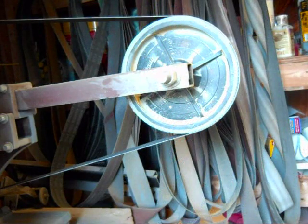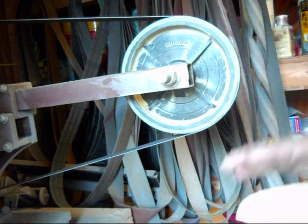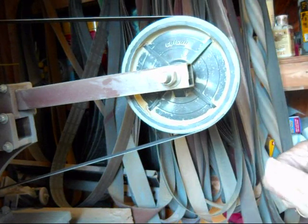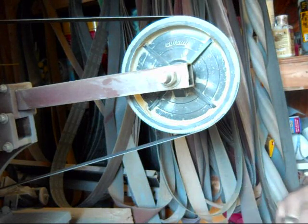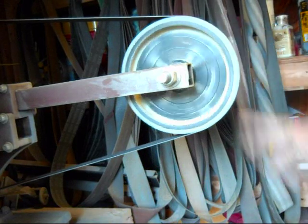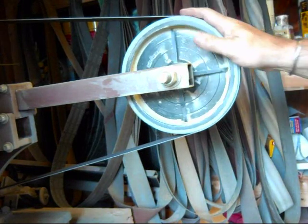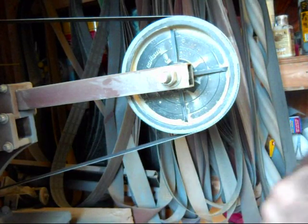All right, the next step I use, and if you don't have a belt sander or a grinder, you can use other tools to do it. You can hand sand it to even things up, or they have burnishing tools to smooth that leather out. But I use this because I've got it. It's a 2x72 belt. I've got a worn out 50 grit belt on it right now. And I'm going to smooth out the ends, and it'll kind of burn it here and seal those ends and make everything a little bit more even.